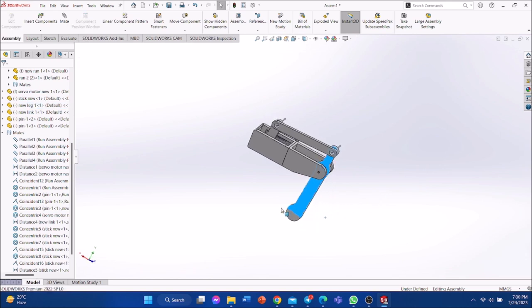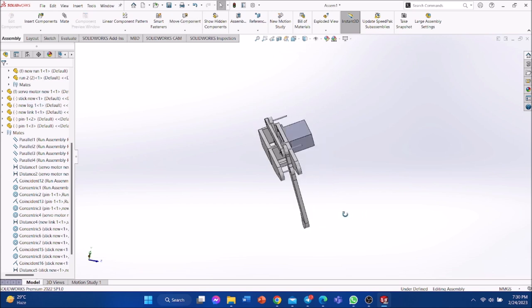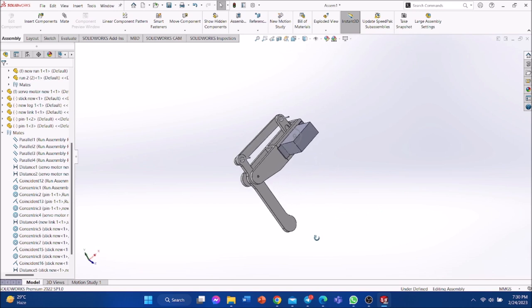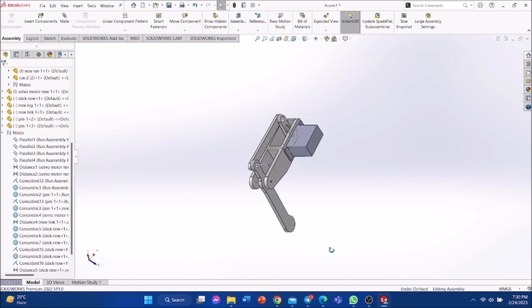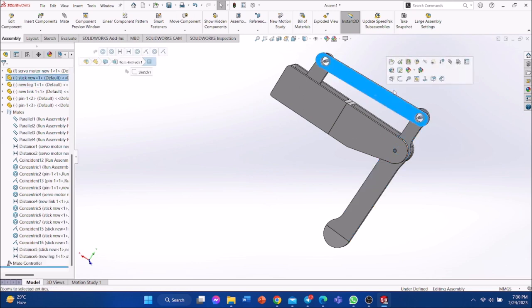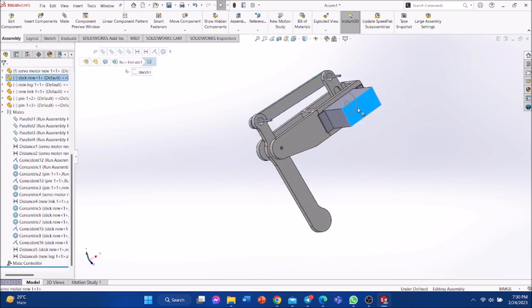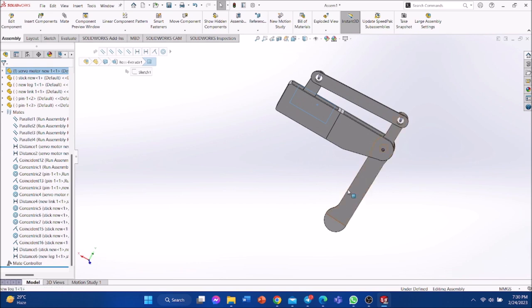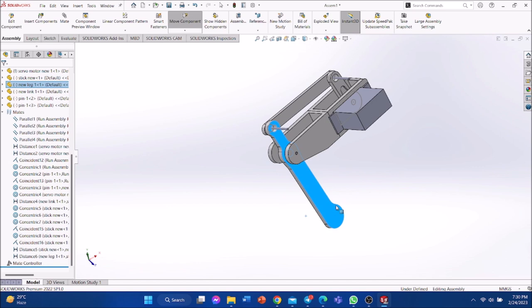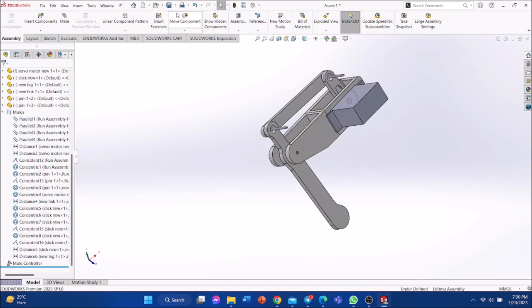Now, many YouTube videos and projects from the previous year used 3 servo motors in each leg. However, the problem with having a servo motor connected at the knee is that it has to constantly support a working torque, which can cause the servo to overheat and potentially become damaged. So instead, we opted for a simpler design using a link and moving the servo motor that was previously connected at the knee to near the hip servo motor. This made our leg design more efficient and was a great idea suggested by Iqbal Bari and Mahdi.